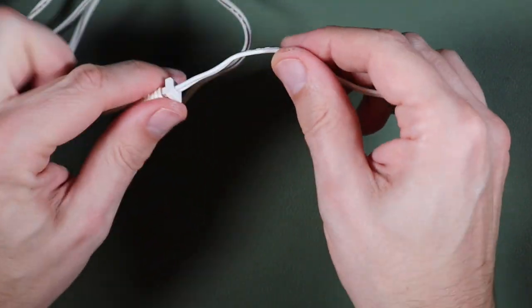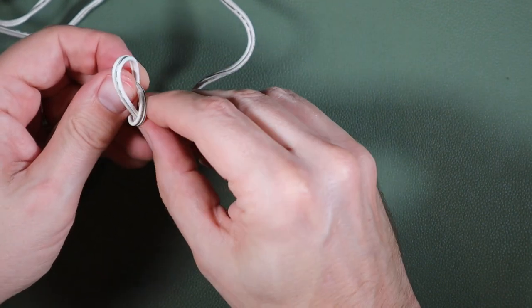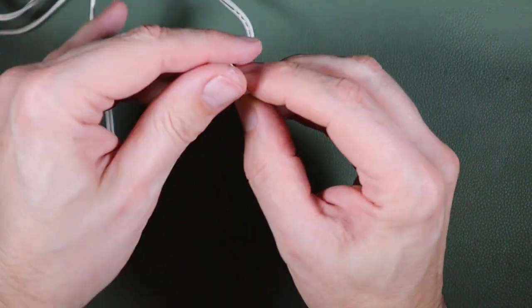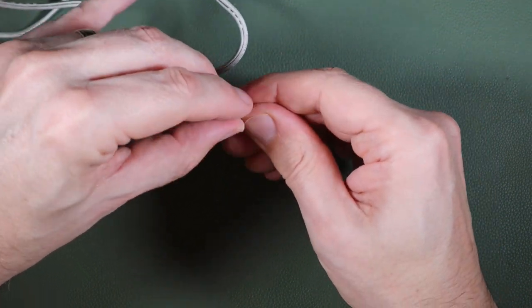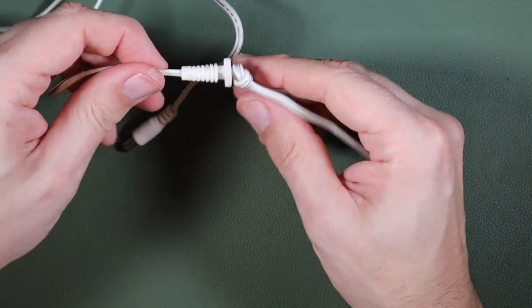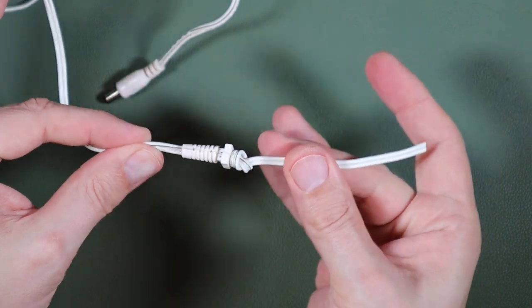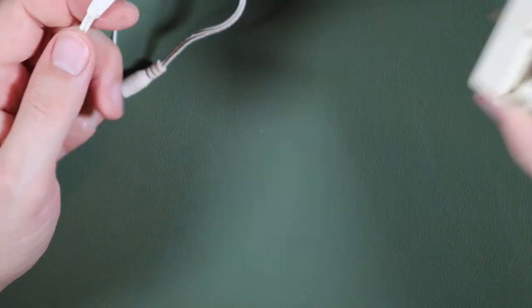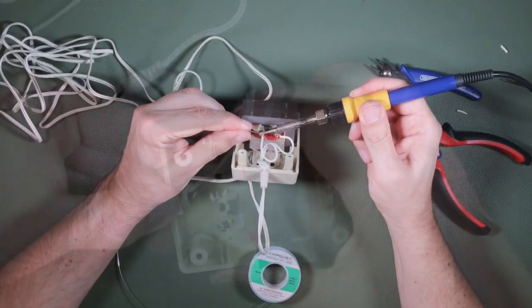I'm probably going to tie a knot in this side of it so that we have a little bit of additional strain relief, given that it's no longer injection molded in there. That might not really be necessary, but I've chosen to do it anyway. And if you have any comments on whether you think that's a good idea or a bad, please leave a comment in the comment section. For now, though, we need to get it soldered back into our power supply.